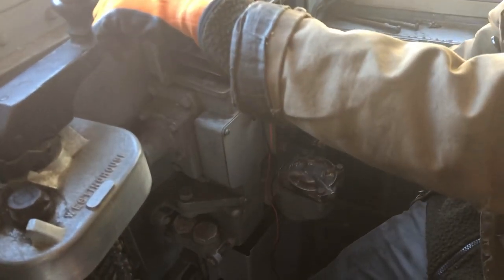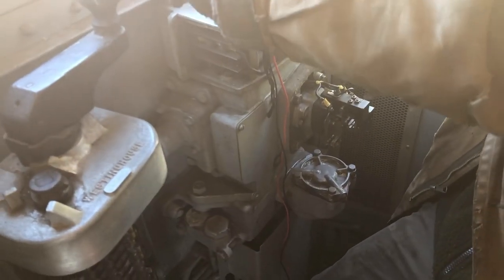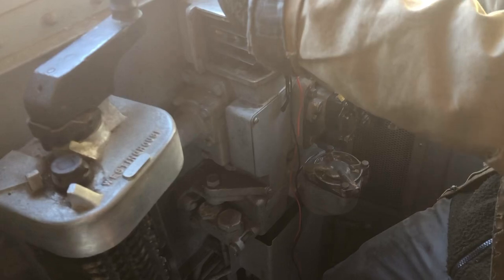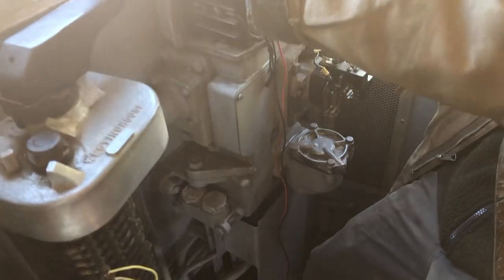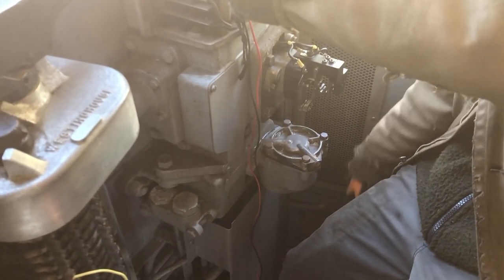There's a little plunger in here with the air pressure — that's the equalizer. It's like a pneumatic air regulator, except it has a little piece that comes out which controls this. You see how that moves as I slowly take on more brake, and you're not hearing any sound coming out of this — it's all happening downstairs.